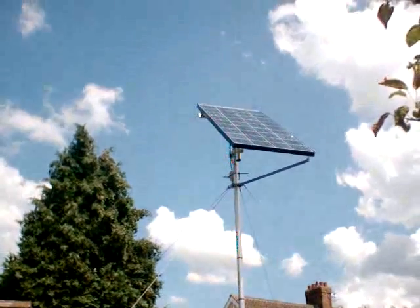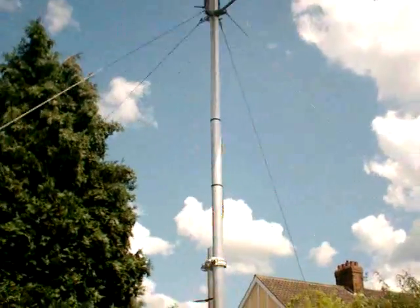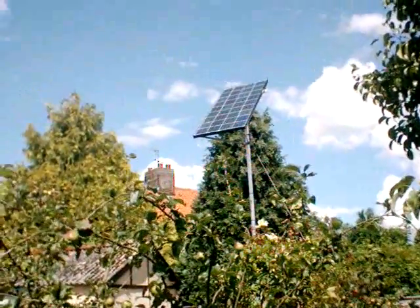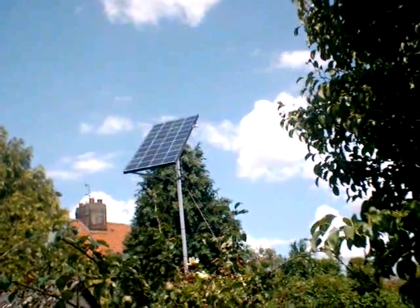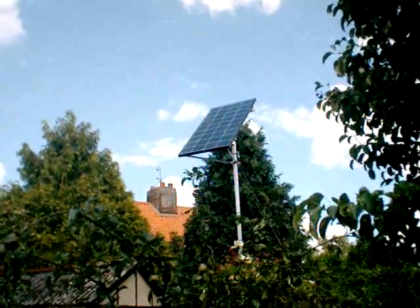I run a radio so easily it's unbelievable. This is the new panel, 130 watt. I very quickly had to put it up — didn't want to waste any time getting it up — so I've actually made a bracket system and got it up within about an hour. It's approximately about 15 degrees off south, slightly to the later part of the day, which seems to be the best position. It's doing extremely well, kicking out 8 amps at the minute.